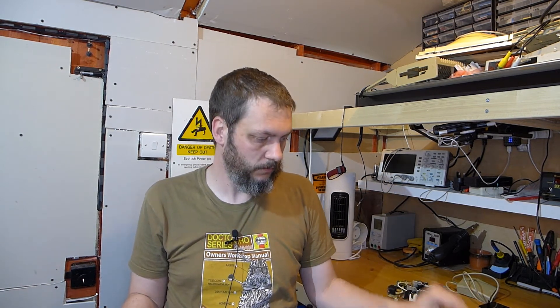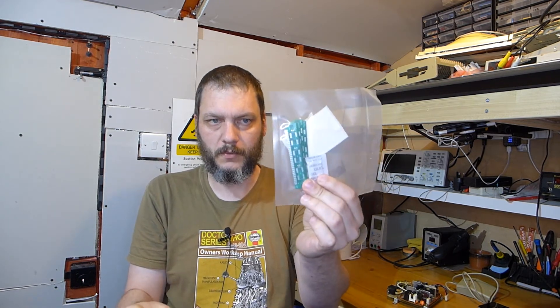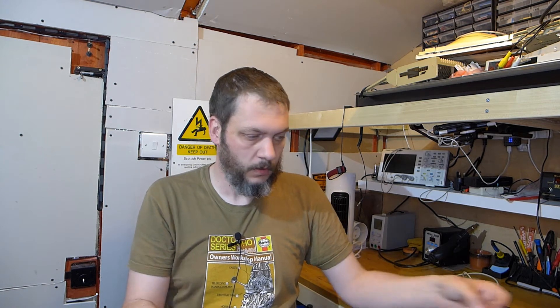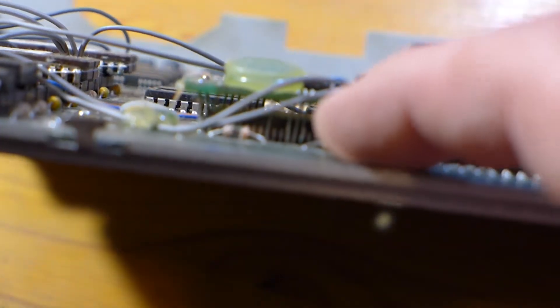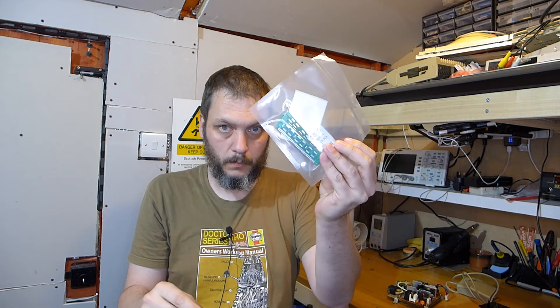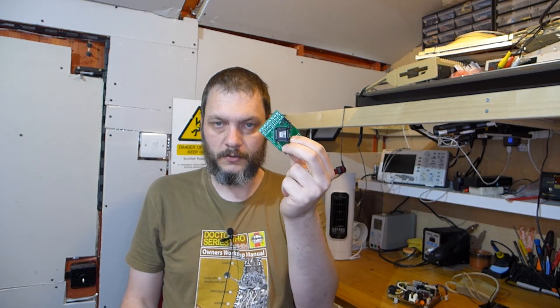So in future videos, I have these — now these are 30-pin SIMMs, but this is just the PCB. I had these made following some designs I got off GitHub. I've never made PCBs before — let's see if these work. I need RAM chips for them. So I've got a 72-pin SIMM module, so I'll need to desolder this. In another video — probably the next one — we'll look at the ST's RAM upgrade that's in it, figure out how it works, take these chips off, put them on here and see if this works. To make debugging easier, I've got a diagnostic cartridge that has a memory checker on it, so I can check all the RAM is working correctly.